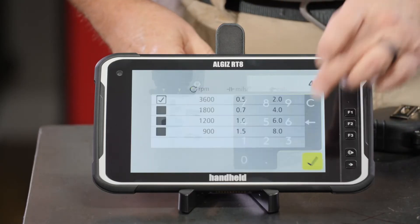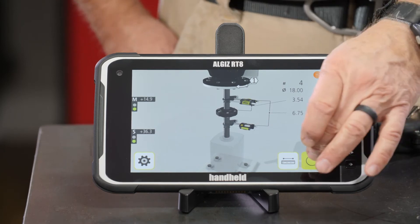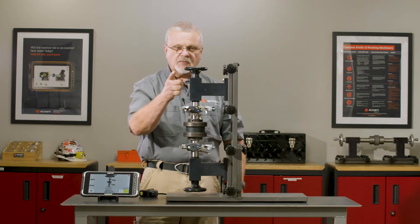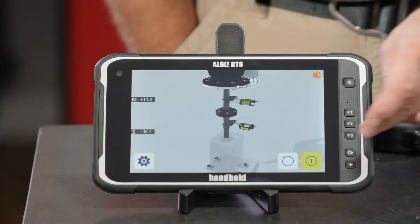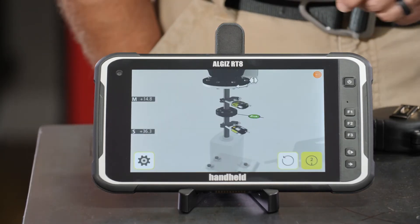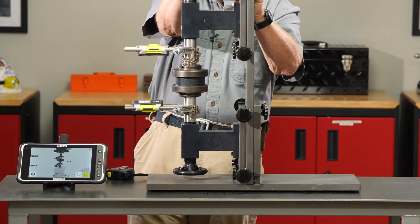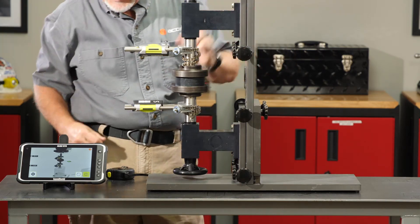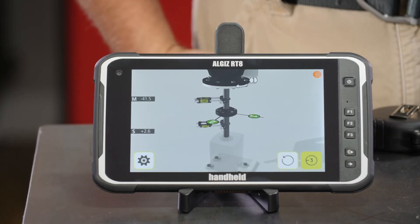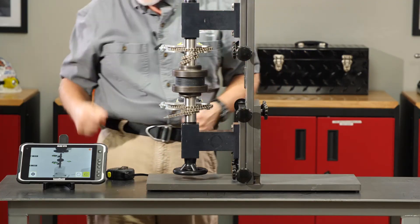Now I'll hit the check. I'll set the RPM — let's say this is an 1800 RPM machine — to set my tolerance. I'll choose my measurement icon, and if you look here I've got a hash mark and the number one. So I'm going to aim these rods toward bolt number one and take my first measurement. That hash mark moves 90 degrees on this icon, and I'm going to rotate my shafts until I'm pointing toward bolt number two, which would be a 90-degree turn. I'll take the second measurement, then rotate 90 more degrees to take our third measurement, pointing back to bolt number three.